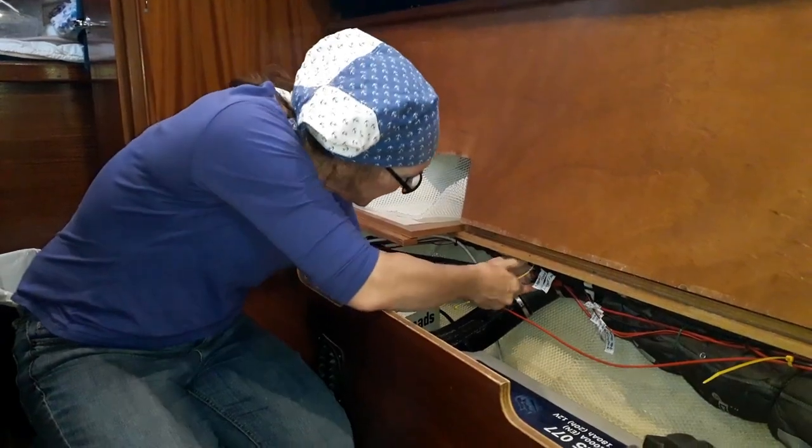What Beverly and I have is a mousing line underneath the floorboards. We've attached the wire, the mousing line, and an extra bit of string together so we can run the cable underneath the floorboards. Then you undo — you've got the line through — and you use the string to pull the mousing line back. It's one of those really useful things to have once installed. Never lose it — always make sure it's there. We have a mousing line in our mast, one running to the back of the boat. Once you've got your mousing line in place, don't get rid of it. They're too useful — and don't use cheap string.